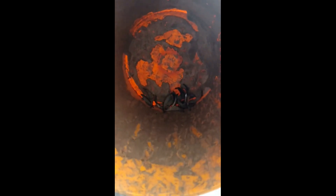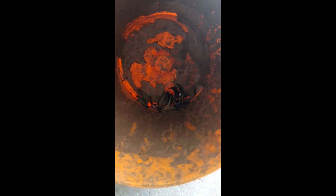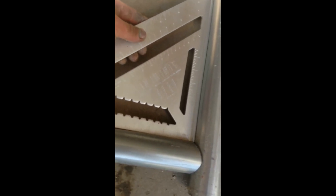I collect all the cut pieces so I don't get a flat tire — highly recommend doing the same. The one and seven-eighths pipes are cut and they fit together pretty decent. I'm marking about an inch on the edge and using a square to make sure the pipes are welded at 90 degrees. I'm marking the 32-foot point and the backstop end. I've done four of the uprights — got the end, the 16-foot mark, and the 32-foot mark where the chain link stops, and the backstop section.